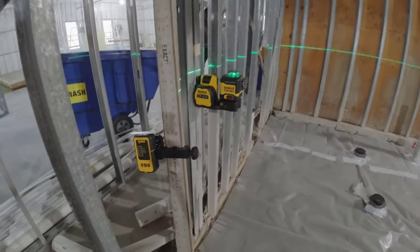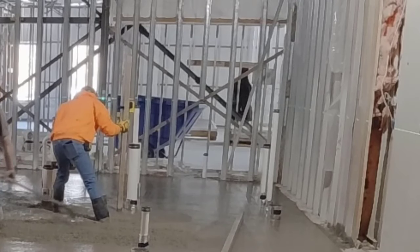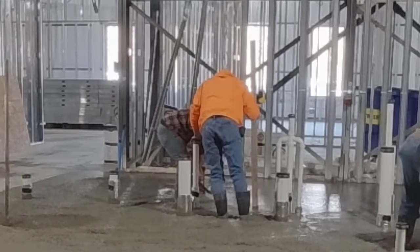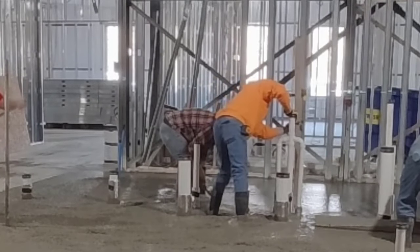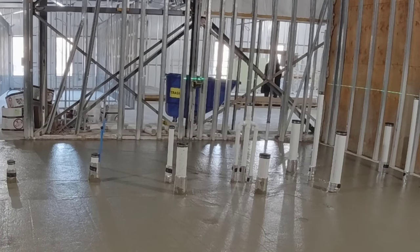Using these power buggies it's pretty fast. I still have the laser mounted on that metal beam way over there in the back. As we pour the concrete, we need to set what we call wet pads — grade pads — in the middle to strike off the concrete and make sure it's really flat. If you do a lot of concrete floors or slabs like we do, having a laser with a high-visibility beam like this one is critical to making sure your job comes out just the way it's supposed to.